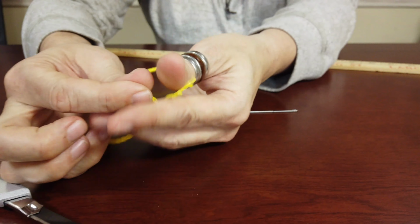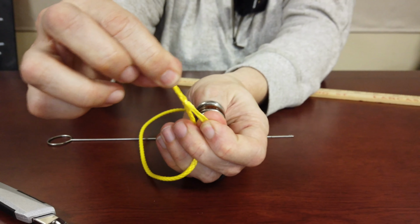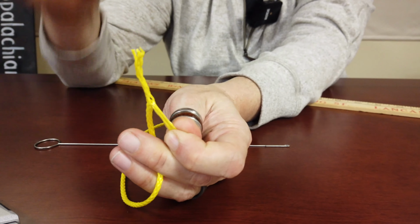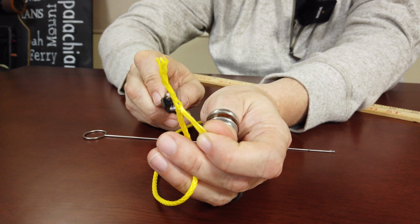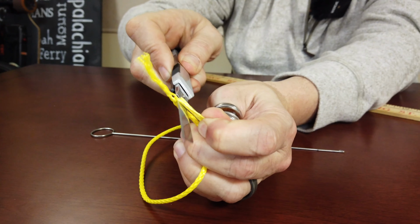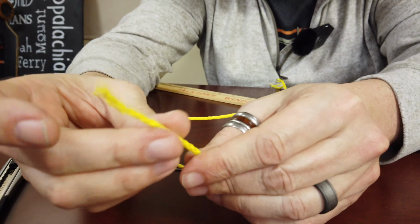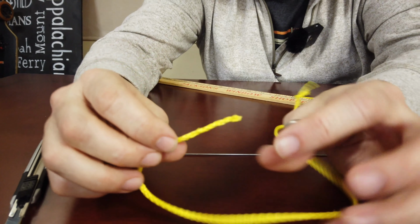So the way I hold this rope is I pull the 5 strands straight up, and I pull these 3 strands, I hold over here, and I pull here. There's pressure on all of that. Now, I have, at the apex of this is where all those strands are. And we just cut with a sawing motion, and hopefully we have a nice clean cut there. And this will be very easy to feed back in through each other.